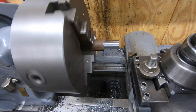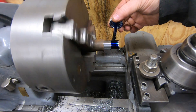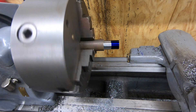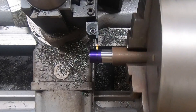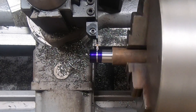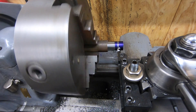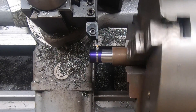I'm going to slow the lathe down quite a bit here because I just don't trust myself when I'm threading. I'll put a little layout dye on the end piece so I can run a scratch pass and make sure I have everything set up correctly. I have a radius grooving tool in the tool post and I'm going to cut a thread relief about 30 to 40 thousandths deep where I expect the thread to end - I think this looks a lot nicer than just stopping the thread, and it gives me a little wiggle room when cutting.